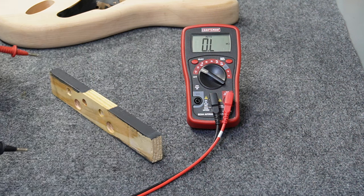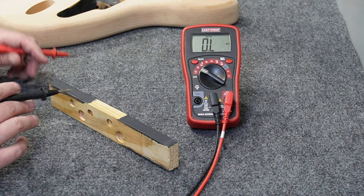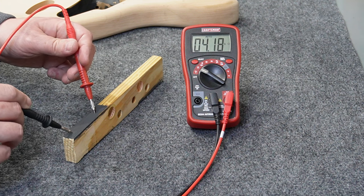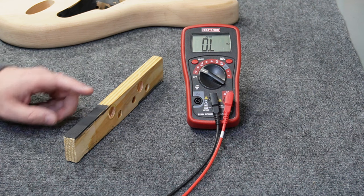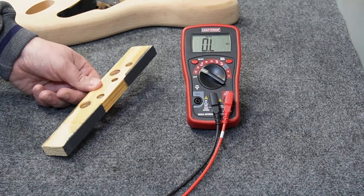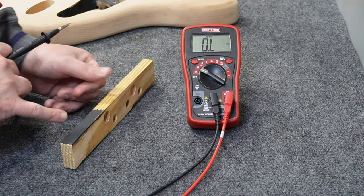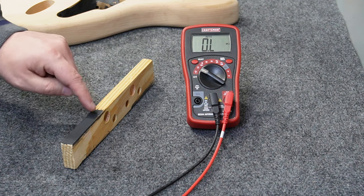The one-to-one mix measures 24k ohms — that's what we saw on the guitar body. Now the reason I tried more graphite is because I thought more graphite means more continuity. The two-to-one mix measures 1.6k ohms — that's about 20 times better. Now let's try the one with the water thinner — that's 5k ohms. I probably would add a little bit more water; I added about 10 drops of water to the two-to-one graphite-to-craft-paint mix, and it made it flow a lot better. The one-to-one looks nice, flat, and even with no brush marks. The two-to-one has heavy brush marks because the graphite builds up in the grooves between the brush hairs. The water-thinned version has semi-heavy brush marks, so I think if I thinned it out more it would be better in the long run.